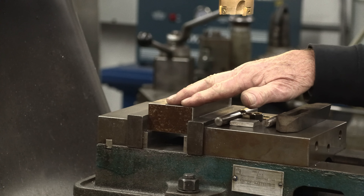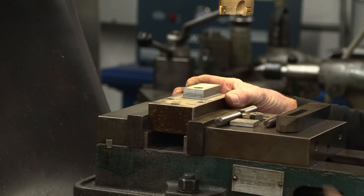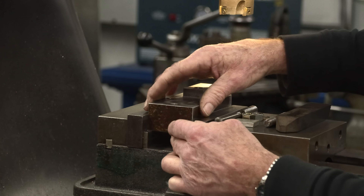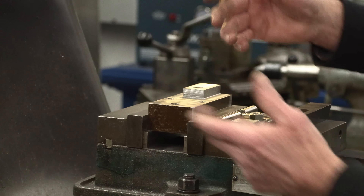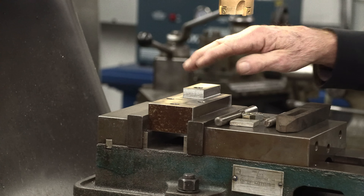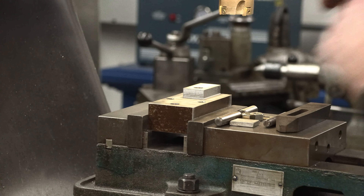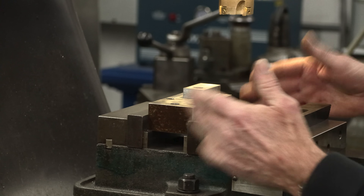This is a block of tooling — that's what I call my material that's not for my customer. Anything in the shop that's not for a project is for tooling. We had this chunk of square stock; I didn't even have to cut it to length. It was already the right length. I did hit it on the sander just to dress off the sides. We took our block and put it in the mill vise, locked it down, and everything's 100%. We haven't moved it since we put it in here. The whole job is: you machine your platform where you're going to mount your piece and do your work.